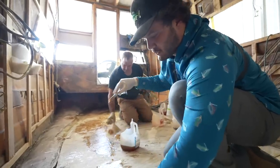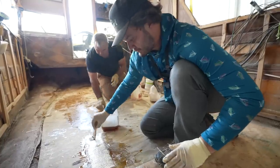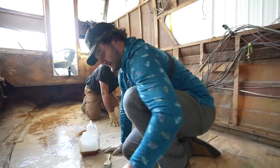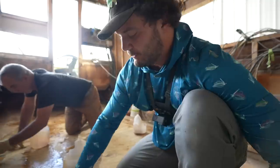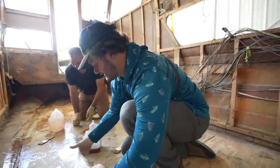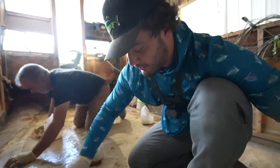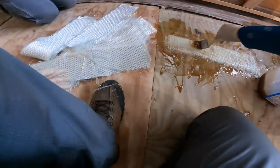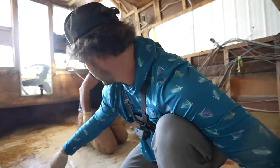One thing me and Tim discussed that we didn't cover in the previous video — a lot of you were commenting on the drainage in the bulkheads. This boat was made imperfectly and only produced for a couple of years; there were a lot of funky boats in the 70s. What we found was the current drainage system — the actual shape of the holes — was not allowing water to drain all the way through the floor. It would pool up in multiple sections, rotting everything around it. So we decided to remove every drainage hole and fill every area with foam.